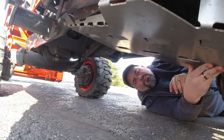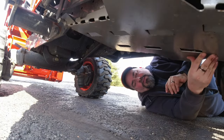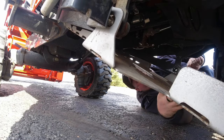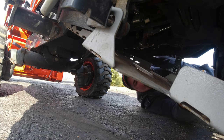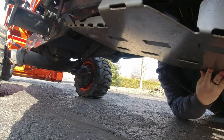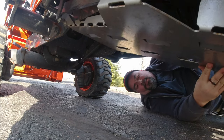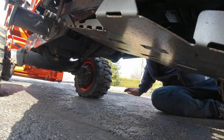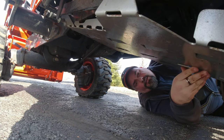There we are. So this will freely work when I'm using my three-point attachment to the back — this will go up and down. This is fantastic to protect all the innards, but I don't need it to come down this far, so let's just rotate the knob now, a little higher — there, I'm happy with that. So that's how you adjust that rotating knob — it's just a metal press fit that rotates, with indented different sizes to allow you to change the height of the mid-mount mower.